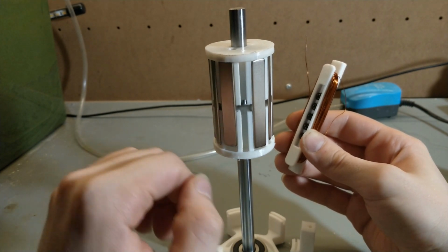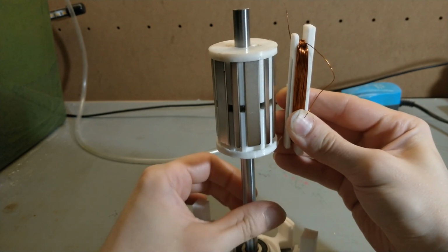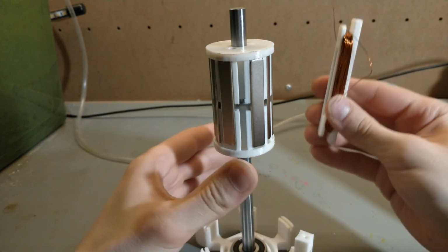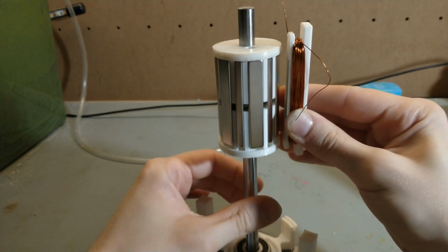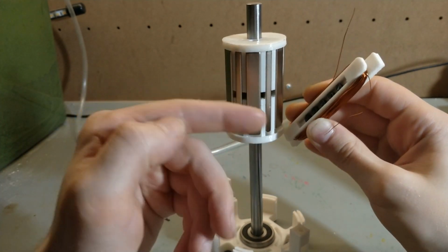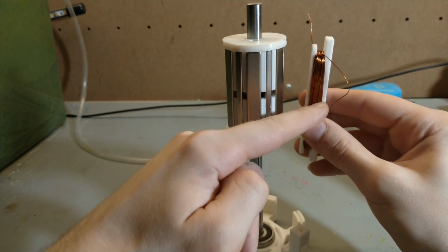And we need a highly ferromagnetic material at the center of this coil because, as we know, we generate most electricity via passing a magnetic rotor across a coil of copper wire, and that's how we get most power. However, if we just had the wire and not the actual ferromagnetic core inside there, what would happen is the magnetic field from the rotor would not penetrate as much into the actual wire itself, and so less current would be induced. However, what's happening here is the magnetic field is passing a little bit into the actual iron there, and that in turn is generating its own little magnetic field, which is inducing a little bit more current in the actual coil itself.